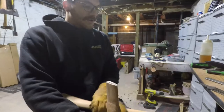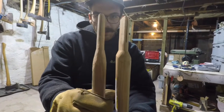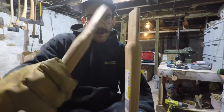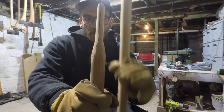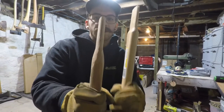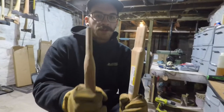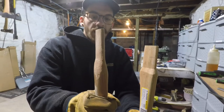I have another trooper handle right here — this is what we started with, and this is what we got now. You see the difference? You see why this is a problem? The head just stops. Now we knocked this down to make a nice taper. We didn't really touch too much here because we were sitting okay there. Now we're going to test fit the head again and make sure we've got good head alignment.